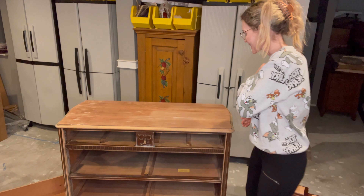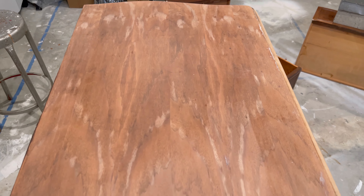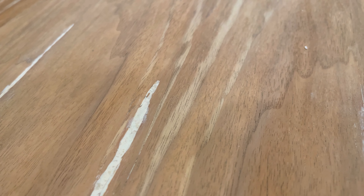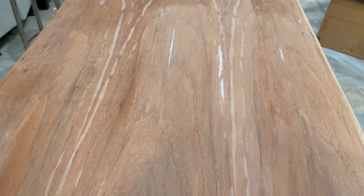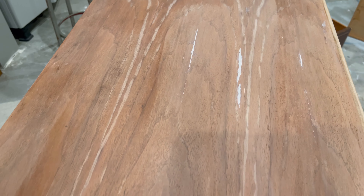This is looking pretty good — I'm getting excited. I just might have saved this veneer. Looking at the close-up: the wood on top already has a lot of variation in the grain, and once I get this stained, I can camouflage these lighter areas. Look how flat those bubbles got — it is completely flat now when I run my hands over it, and I filled those gaps with the quick wood. I was using 150 grit; now I'm going to take 180 grit to the entire top for one final sanding before I do wood conditioner and stain.